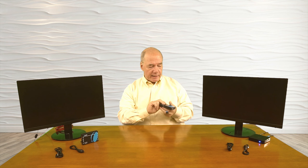Now the only thing I'm missing is the network cable between them — and again, these can be 165 feet apart. That network cable has to be a Cat5e or Cat6. I've got a very short cable here, but this is a Cat5e cable. I'll connect one end up to the transmitter module and one end up to the receiver module. As soon as I do that, these two modules will negotiate a handshake, they'll sync up, and that media content will be sent to the secondary location — and there it is.